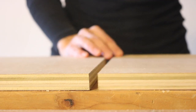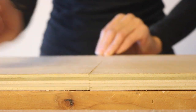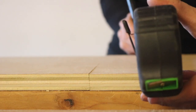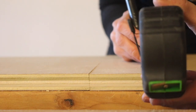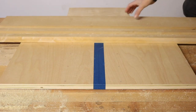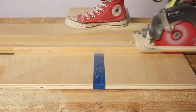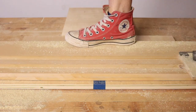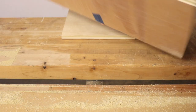I wanted the runners for my drawers to be as even as possible, so I lined up the two sides and made all the marks at the same time so that the measurements would all be equal. Then I taped the two pieces together so they wouldn't wiggle — there's no wiggling in woodworking. I made each initial cut, flipped the board over, and then did a second pass to widen the groove.